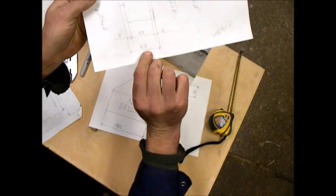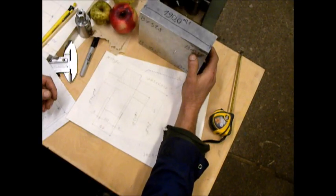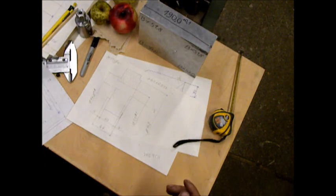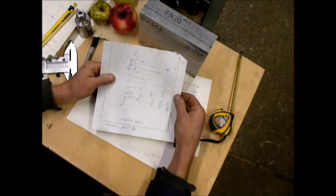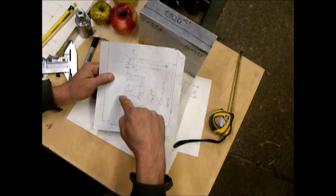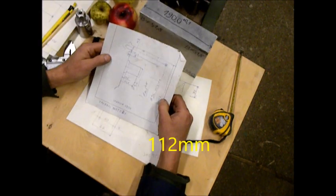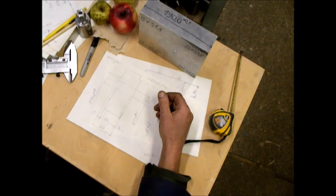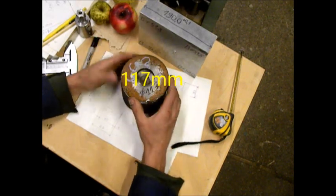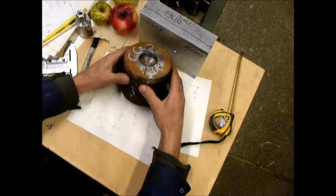I need a thickness of 67 millimeters but this piece has only 52. I need to do something. Looking at the sketch of the new motor, I find out the seat diameter maximum is 112 millimeters. So I need a piece of steel - and I found a piece of steel already in this diameter, unknown grade, and it already has a pre-bore.